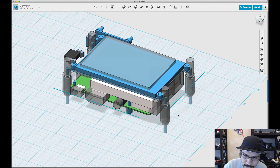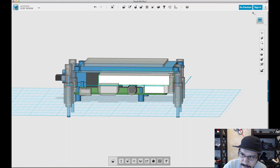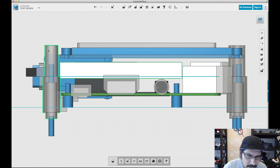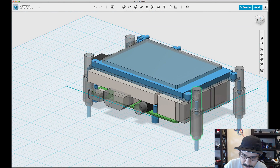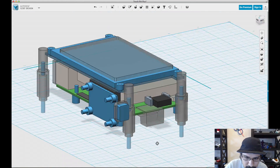The next thing you'll notice if you look at the battery — it looks like it's intersecting with some of the Ethernet ports. So we'll just select it, hit Command or Control T to move it around, and move it over here. I'll put 0.5 there, so now it's away from the standoff and the components. The next thing you'll notice is that this standoff is definitely in front of the Ethernet, so we'll just go ahead and delete that whole chunk and that part as well.